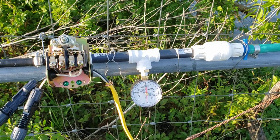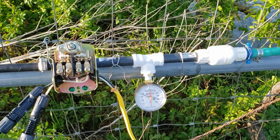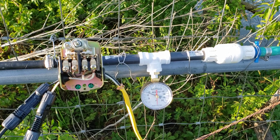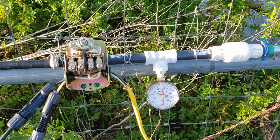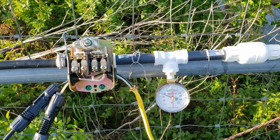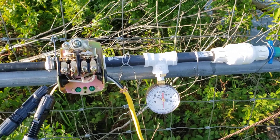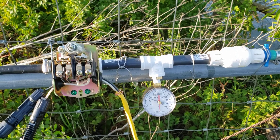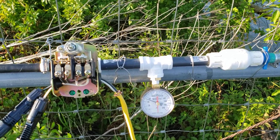So this is going to allow me to set timers in different zones. No matter how much power I'm pushing to the pump, once it hits 60 PSI it's going to cut the power, and as soon as the valve opens it'll drop below 40 and the pump kicks back on. Right now I'm going to two zones using these simple 30-dollar Home Depot water timers. If we get more complicated, I'll move into an actual solar-powered control box with individual valves managed by that controller.